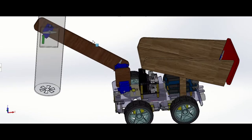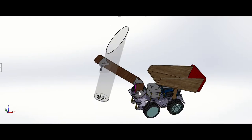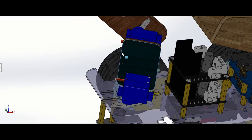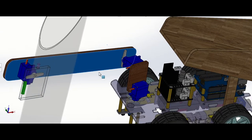For the robot arm, this is the design of our robot arm. We are using servo motors to rotate the robot joints. This servo motor is for the movement rotation in the Z axis, and this servo motor is for the movement of the Y axis.